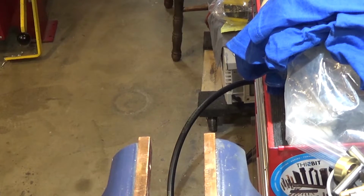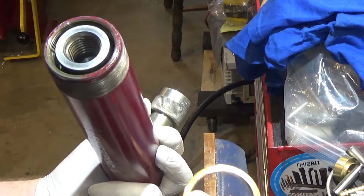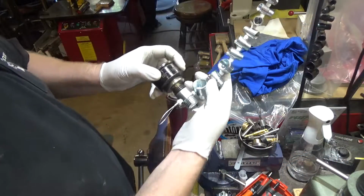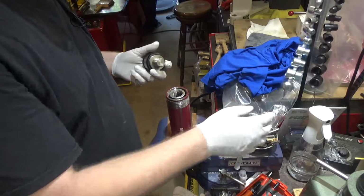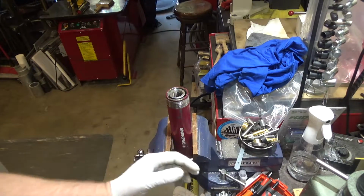So here is a spacer. I just popped it upside down, and it looks like it was flat on top, flanged on the bottom. I have this thread checker over here, and it looks like this is 1/8" threads. If I happen to have a 1/8" bolt, I could just drill out the center of it, and that could be handy. Let me go see if I do.